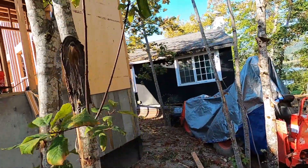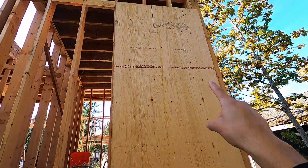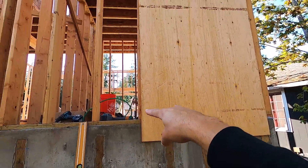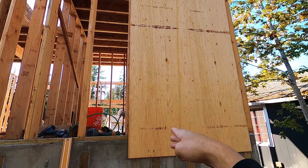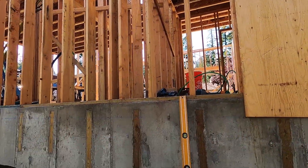Because I am the world's worst camera operator and I get in work mode, we have our first sheet hung. Now this is what we're going to be hanging — we've got to have nails every six inches on the borders and then every 12 inches in the field. So every six inches on the border of the sheet and every 12 inches for the studs in the center. We're going to nail the sheet down and then keep running sheets all the way across.